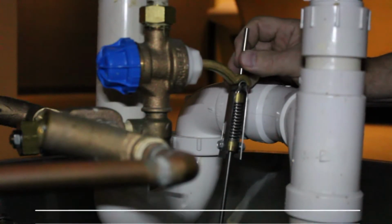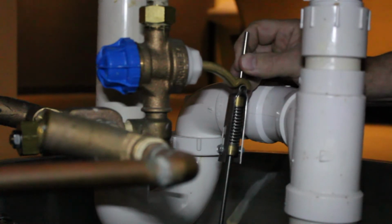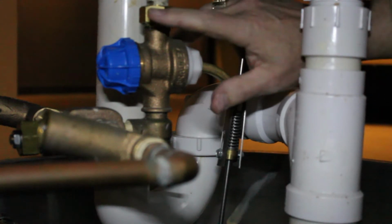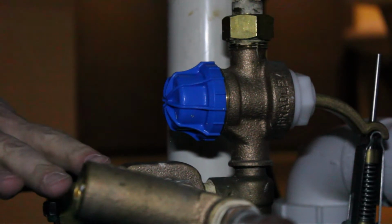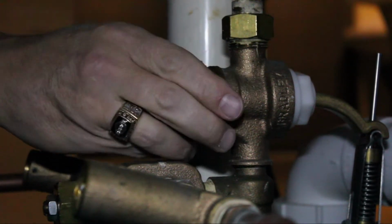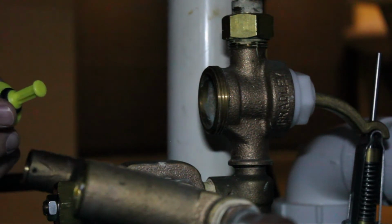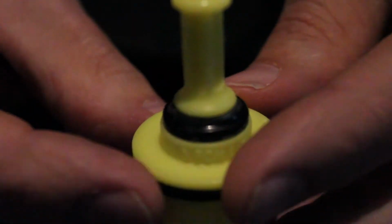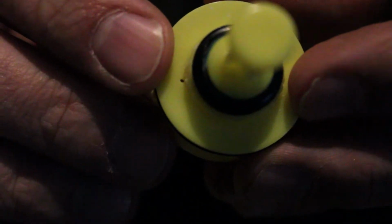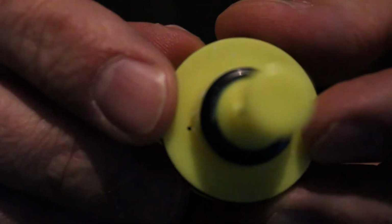If you push up the brass lever with your hand and it doesn't move, and you'll know it, you can try as hard as you can, then the issue is most likely with the foot valve, the area with the blue cap. The cap may be a different color in older models. Turn the water off at the check stops, then unscrew the cap and take out the spring and plunger assembly. You may need a bucket to collect the water that spills out. In most cases, the issue is with the yellow plunger. The tiny hole in the plunger can get plugged up with grease or debris. Simply clean off any grease or debris and put the plunger back in, and most likely this will solve the issue.